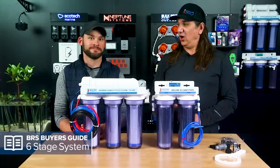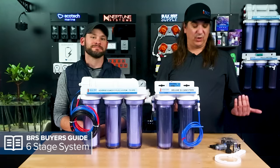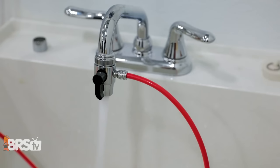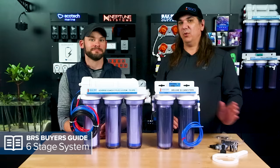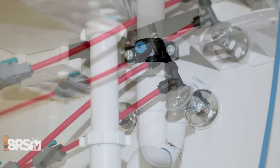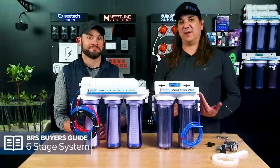With the six-stage, you also get additional fittings for permanent installation. Both the four- and five-stage systems come with the most common connections — a laundry faucet attachment or an adapter for a kitchen or bathroom sink aerator. But with the six-stage, you get a ball valve to turn the unit on and off, a connection for supply lines underneath the sink for a permanent install, and a fitting to connect the drain or waste line right into the trap under the sink. So along with the DI redundancy advantages, you also get the hardware for a permanent connection.